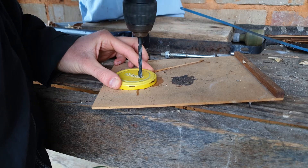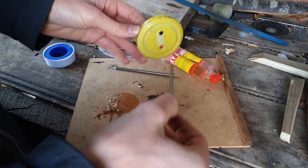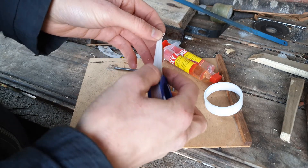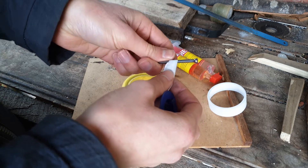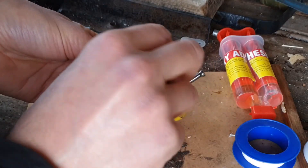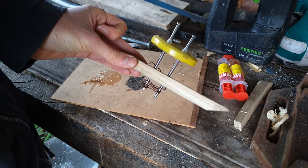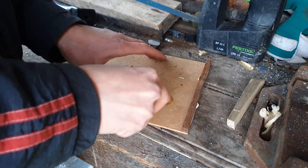The first thing to do was to drill two holes in the lid of the jar for the nails. The nails are going to be the conductors that go down into the jar to the filament, and we don't want the nails shorting out on the lid, which is also made out of metal. So I'm wrapping Teflon tape around the nails — Teflon has a pretty high melting temperature so should be okay to hold the nails in place.